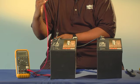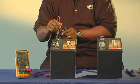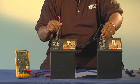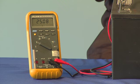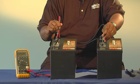Taking the positive lead and applying it to the positive side of the battery that does not have the connection, and taking the negative lead and applying it to the negative side of the battery that does not have the connection. This will give you a 24-volt DC connection and create one cell between the two, and this is good for your application.